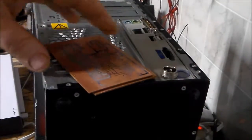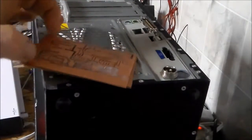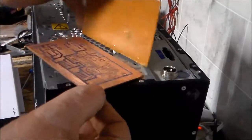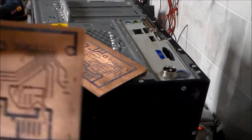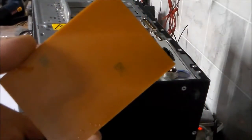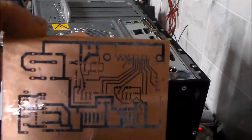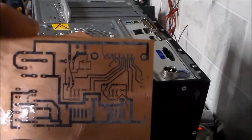Not well. This is the second result. What I found was that you don't want any tape. I have to tape the pattern on, and it's best to fold it around the board and tape it on the back side. If you're doing a double-sided board that would be a little bit harder, but you can see some of the traces pulled up on that one.